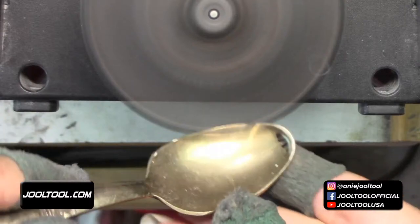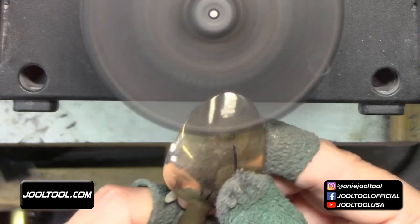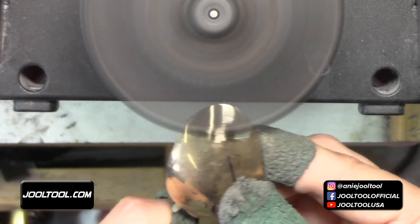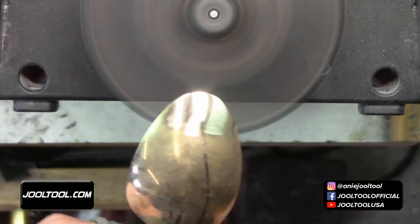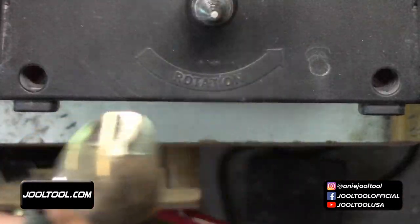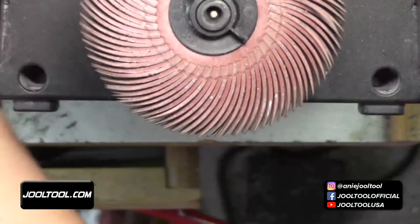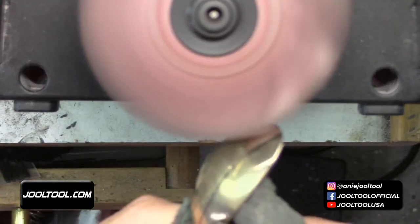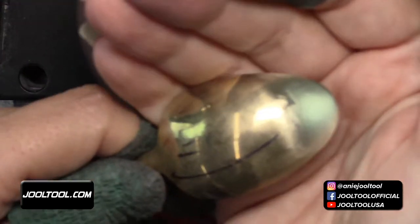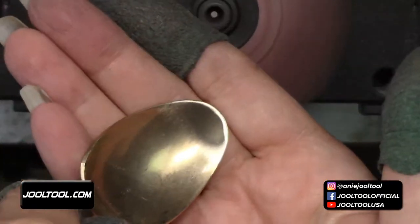So there, that's that. And then again, back here, you guys see? This is a little pitted, so let me clean up some of the pit. You see that? So now, it's two ways. If it's polished, you polish it. If it's matte, take a 220 grit, or whatever you have to match, and just go like this. And just put that satin finish back on. You guys see that? Hold on. There, you see the satin finish? Same with this one back there. It puts that satin finish back on beautifully.